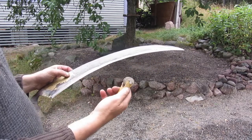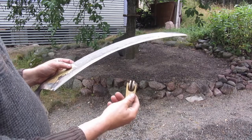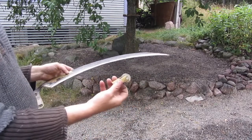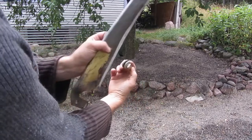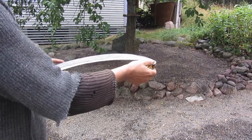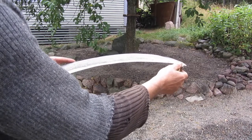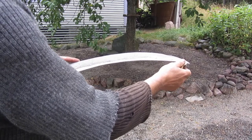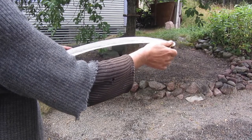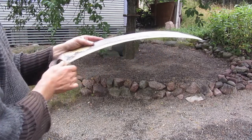It's quite easy when you have learned to do it. But it's very important that you understand how this works. It's not that you move the blade in parallel with the wheels — you have to twist the wheel and have an angle. You will have a slight angle between the blade, the edge, and the wheels. So what you do is place it on the edge, then twist it until you feel the resistance — that you can't move it any more. Then you have the good position. And you roll it over the blade like this. You can make this as many times as you want until you have the good edge.